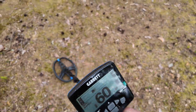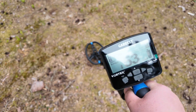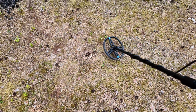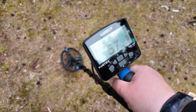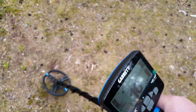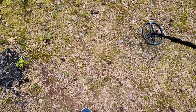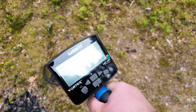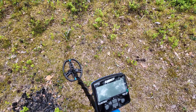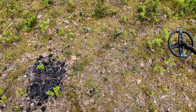Really nice sound — good object. Now 20 centimeters — for most metal detectors, 20 centimeters is a critical depth, and here the detector catches the non-ferrous signal. At 22 centimeters, it reads slightly ferrous because the coin is a bit smaller than the previous ones. At 25 centimeters it's even smaller. At 28 centimeters it reads almost non-ferrous — sorry, the mosquitoes are eating me, nothing helps.